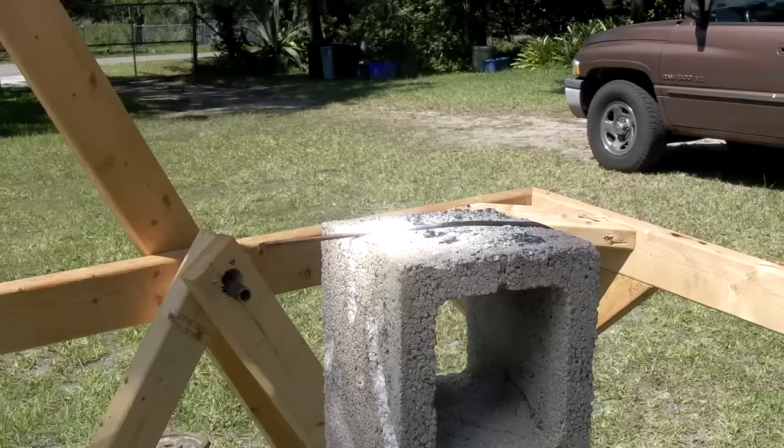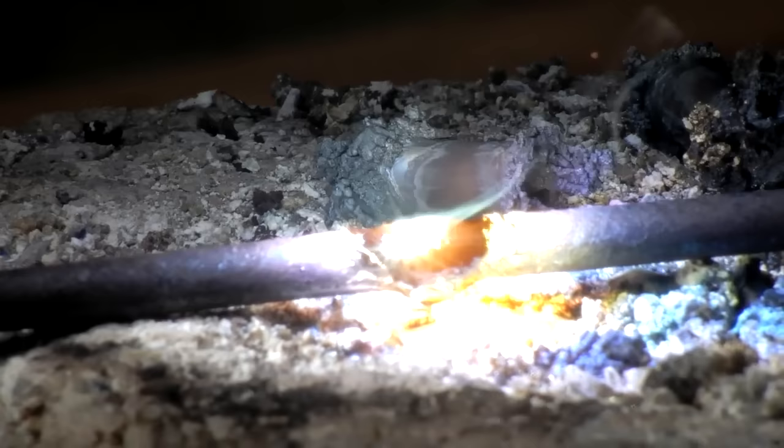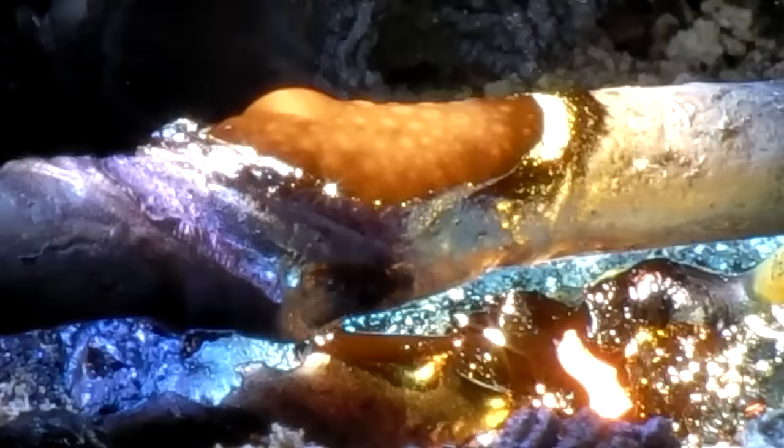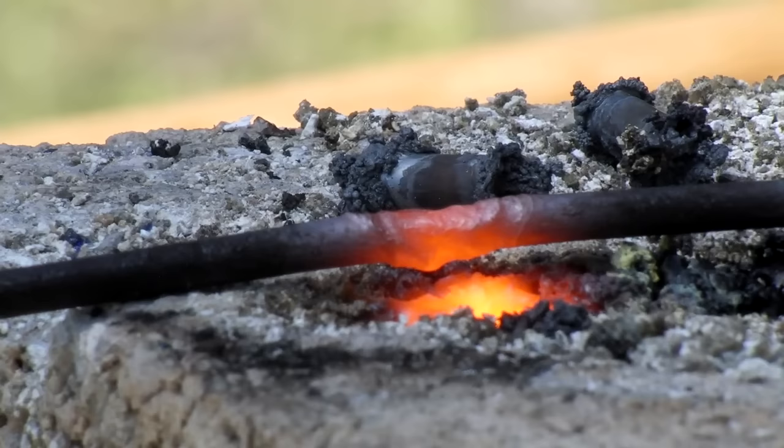Since our results were so promising, it's time to try to melt a steel rod at the center. Melting the tip is easy because the heat can only dissipate in one direction. With the solar tracker locked on target, this 3/16th inch rod becomes a bubbling orange fountain of molten steel. When the exposure is moved off target, the rod glows a brilliant orange, as does the collection area below consisting of copper, stainless steel, and regular steel.